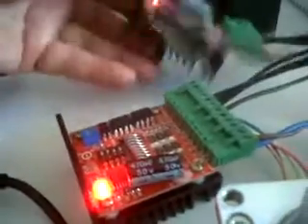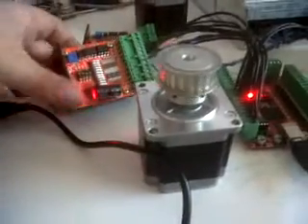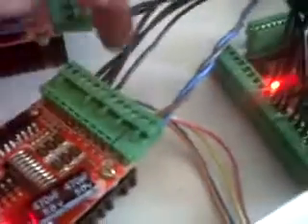As long as you keep the power connected and you have it switched to not go to sleep — well, if the power lead's connected that's all you need do. The reason I've been going on about this is just so — that's running that file there, they've been running for a while and they're not hot to the touch: 36 volts, two and a half amps, not hot to the touch. The driver — it's not cold, it's warm, but it's not red hot. It's not about to emit the magic smoke. So if I were you, I'd buy that lot.